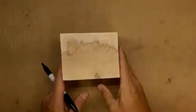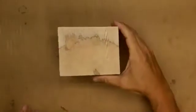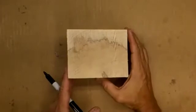We're going to start off today with a block of wood. This is hard maple. It's 16/4 and it's about 5 by 5 inches. It's just dried hard maple. It has to be dried because you have to glue the joints and you can't glue wet wood. So it's real important that you get dry wood for this. I can buy hard maple really affordably at a big lumber yard in downtown Los Angeles, but sometimes it's a 12-foot board, sometimes it's a 16-foot board, and you have to buy the whole thing. So you can't buy small pieces of it, but if you have a source for buying dry wood, then you can do this.